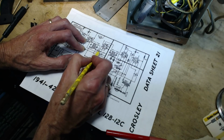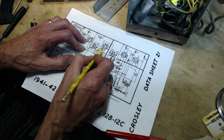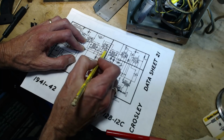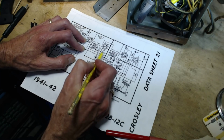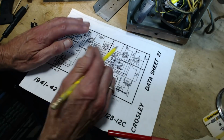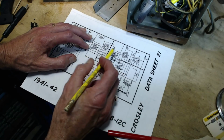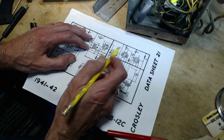So this capacitor is really placed kind of between the cathode and the grid. So the fact that it's floating a little higher now, I don't think it matters. In fact, I think if this were connected to ground, it would probably not be as good as the way it is. There's no bypass on this capacitor, it's our resistor.